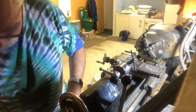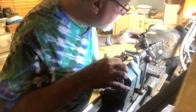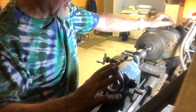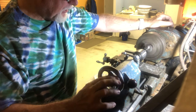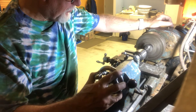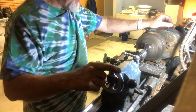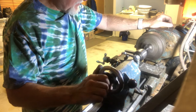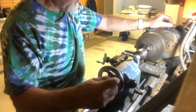This is going to be drilled and tapped, so instead of the quarter-inch I need the 5mm drill, ready for a 6mm tap. Of course there are tables you can look up to find out what size drill to use with different taps, and often it will come with the tap and die set. I'm going to drill this until I hit the hole where the shaft is supposed to go through. If I've got this lined up correctly it should run into the side of that hole and I'll feel it. I don't want it coming out the other side of the block. There we go — I can feel it now, getting across the hole. Okay, it's done.